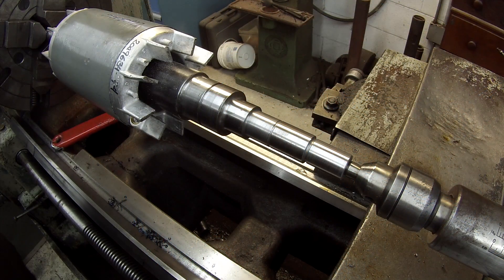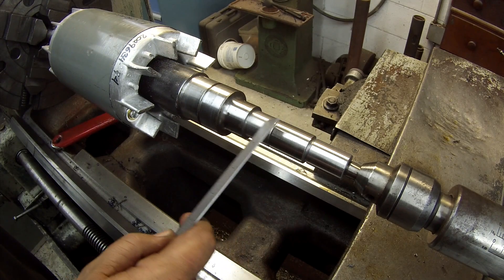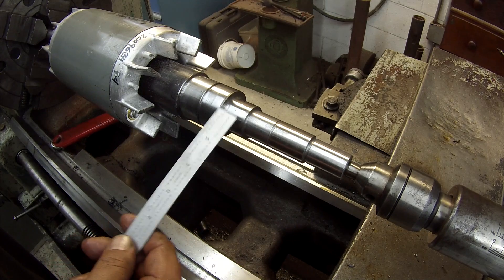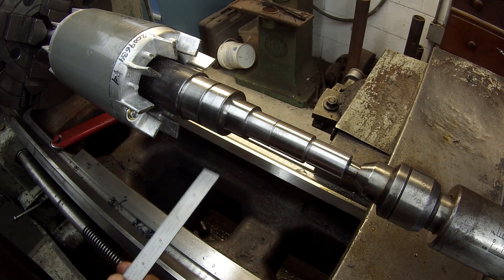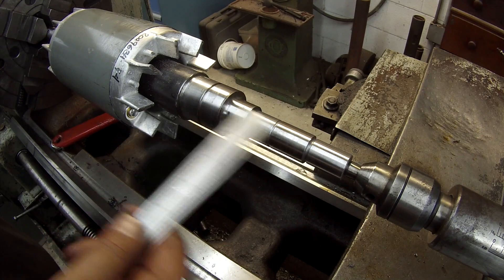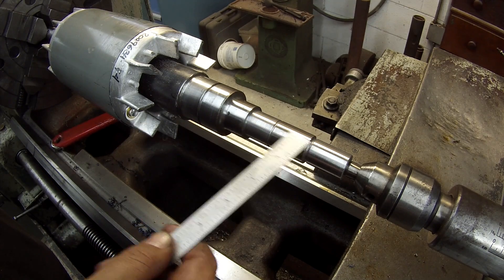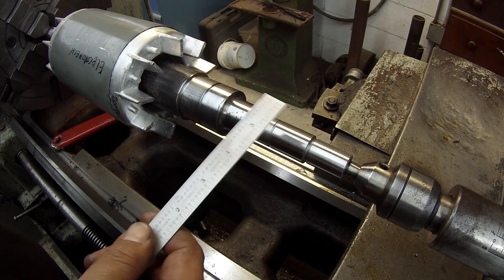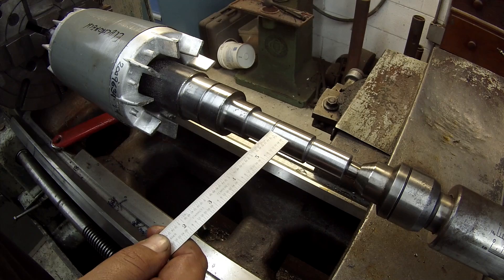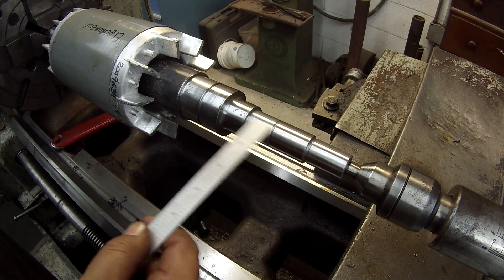So this journal right here, this is your seal journal, or like a mechanical seal. They bring me these shafts every so often and they're used. These factory shafts are carbon steel, and they get rusted and pitted really bad. So what I usually do is turn these down, go ahead and turn it back to this shoulder, and then machine a stainless sleeve and install it right here.